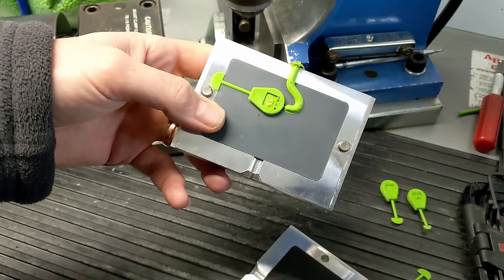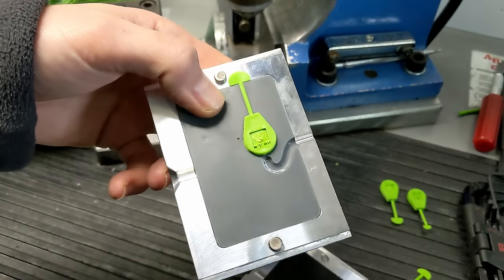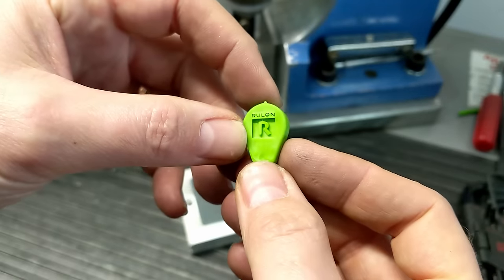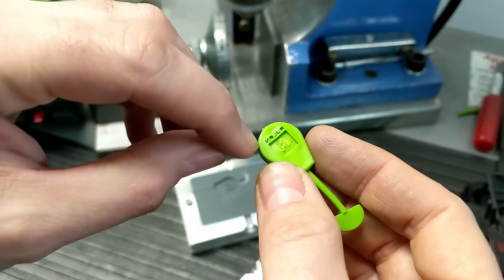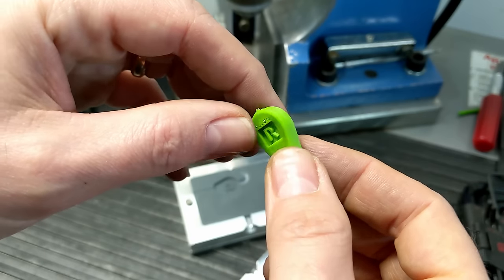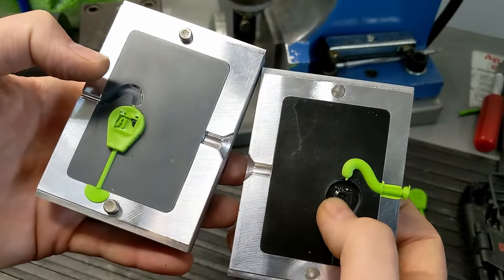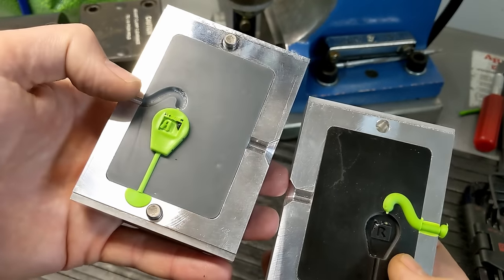The plastic is a little gooey because the 3D printed mold is not very good at pulling heat out of the part — this is where aluminum has a huge advantage. The side with the high-temp resin is performing extremely well. The low-temp side is not — it's already torn out parts of the mold and continues to grab parts of the design. You can see the low-temp mold is starting to disintegrate. Stick to the high-temp resin; the high-temp stuff is working pretty well.